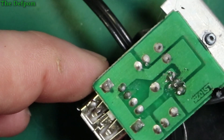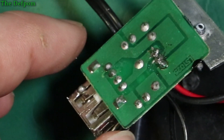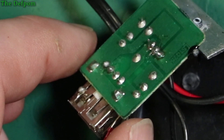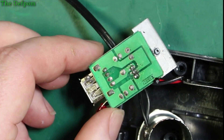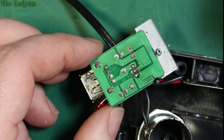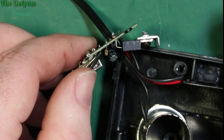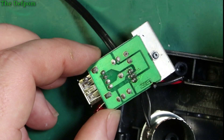Being a linear regulator in here, half an amp will be better than nothing, so I'm inclined to put that in there. There's also other alternatives, like this Apple version which has pull-up and pull-down as well. You can also short the data pins together, which it says gives a high current charger, but I don't know about pulling high current through a linear regulator with almost no heat sink. So I'm a bit on the fence about which method to use.